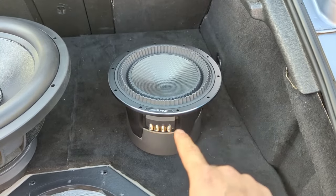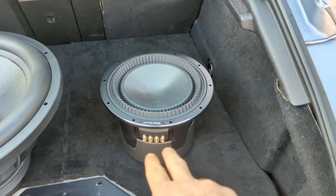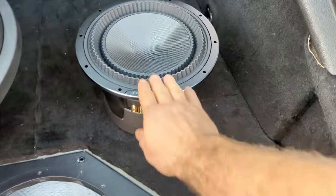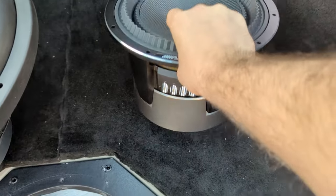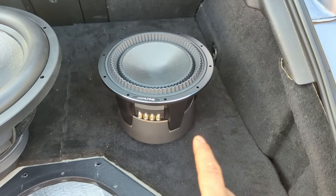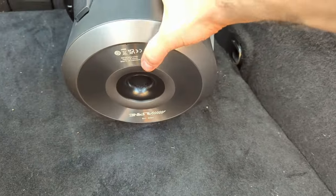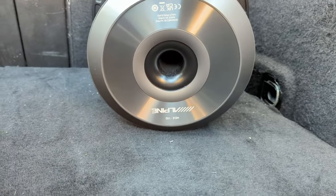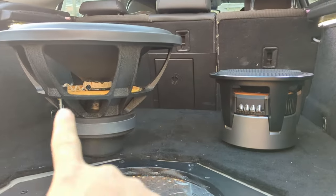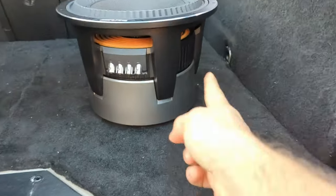I did model this one against the 10 inch Dayton Audio that I have, and this comes out louder. I'm thinking now — with this structure, a smallish cone and this massive motor, BL-wise it has a lot of motor force. So I'm thinking ported would be very, very good for it, because you're not going to push a lot of energy to it but it can absorb. I don't know why it's rated only 400 watts. It has a pole vent, so it has somewhere to vent, but only a pole vent — nothing else. The spider — that's a 10 inch spider on the Dayton — this looks like seven inches, same as the cone. So it's a seven inch spider on this thing.